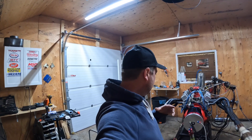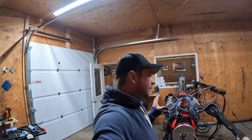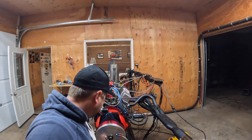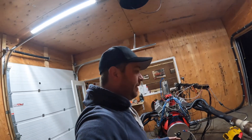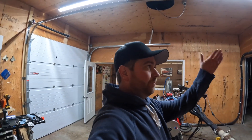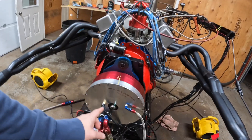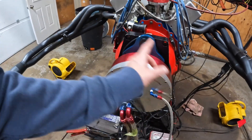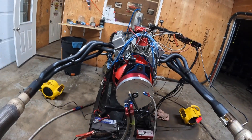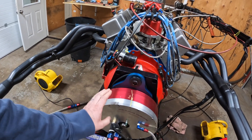So if you guys need some dyno absorber work — that's the proper word I'm looking for — this dynamometer has been repaired a bunch of times over the years. What actually went wrong: there's a little flap in the bottom, and one time we were using the dyno I found it in the system afterwards in the filter. I thought it was debris from the water tank, but it wasn't — it was part of the absorber that stops water from recirculating all the way back around. I was having a lot of cavitating issues because the water just kept going around and around, so that flap stops that and now the water goes straight out instead of eating the insides.